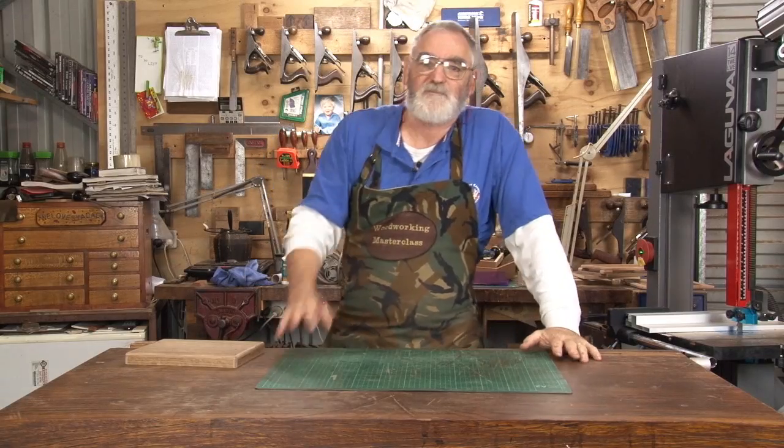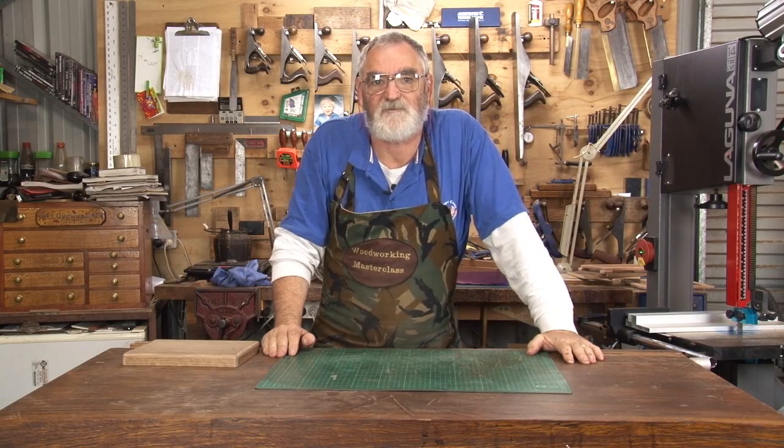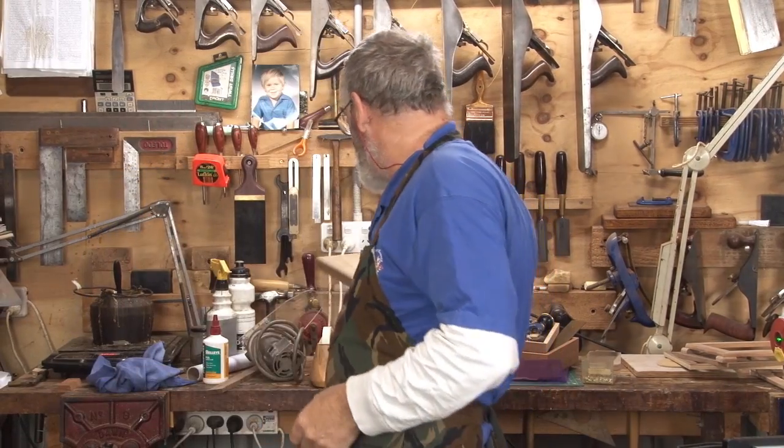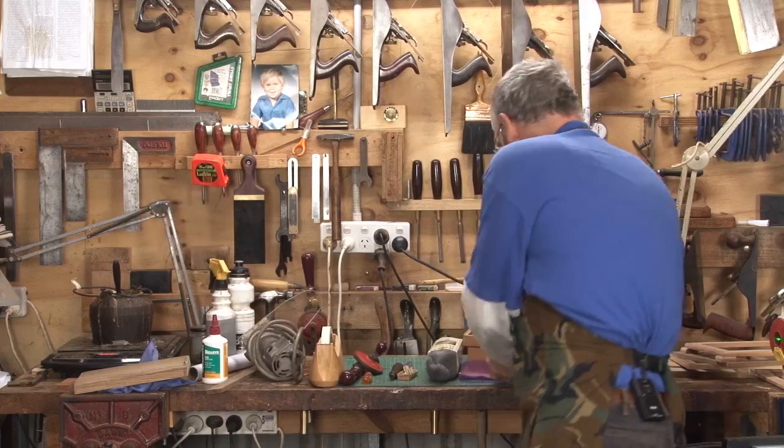Once it's dry, then you can put some brads in there or some screws if that's what you want to do. But that's to tack the stand on. And as I said, I'm not doing that on the solid timber one yet because we've got to fit the hinges.